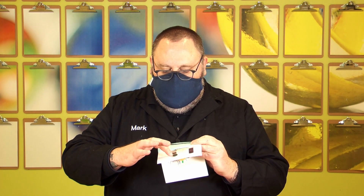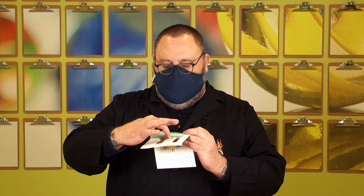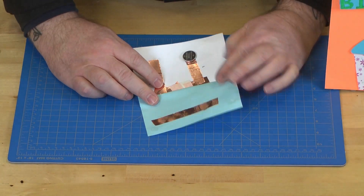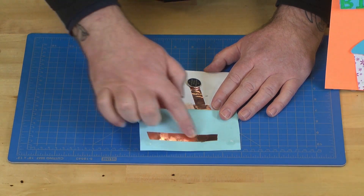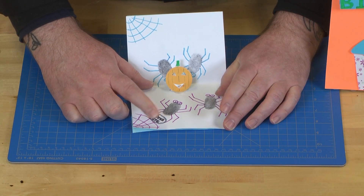So let's take a look at that. Notice that the negative side of the battery goes here and goes into our little LED, which is under the tape. And then this is the positive side. To connect the battery to the positive side, you actually have our little switch. So when you press them down together, it lights up your pumpkin. So: negative side, our LED is under here, positive side, and then this long piece is our switch because it connects the positive to the positive line, getting it to light up when you press your button.